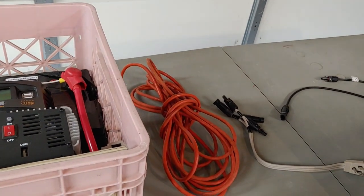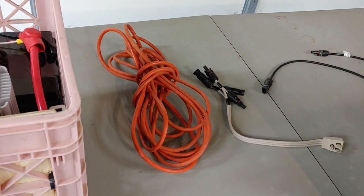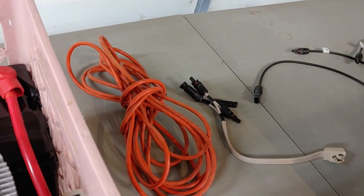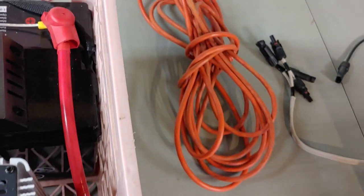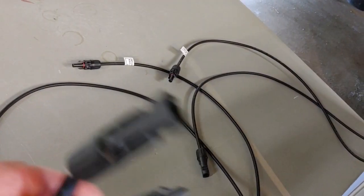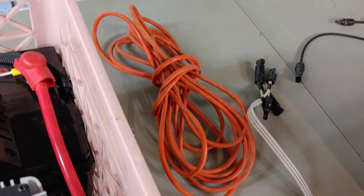To make it possible to run my solar panels to this battery with all the frequent moving, I decided to use a regular extension cord — any length works. It's not the most efficient at the connectors and I'll have a little voltage drop, but it lets me use all the long extension cords I already have. I made an adapter from an appliance cord — heavy gauge — cut it in half, crimped on connectors to plug into the solar panels in parallel, then ran the other half into the input of my solar charge controller. That allows me to run any extension cord arrangement I want. We're only talking about 10 amps, so standard 14 gauge cable does the trick.